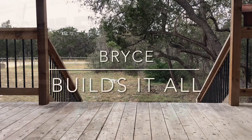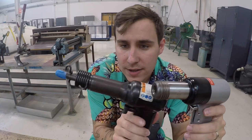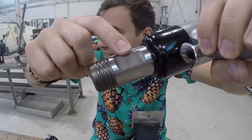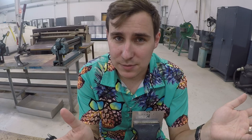The first couple of pieces of advice have to do with tooling. Let's look at the rivet gun you are using — I'm going to show you two different rivet guns. The first one here is a 2x and the second one is a 3x. The difference is the barrel. A 2x is kind of small and very gentle with how hard it hits the rivet. This would work well on a size 3 and anything smaller.